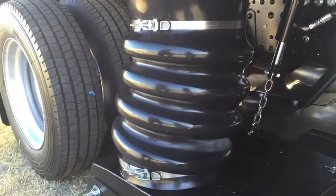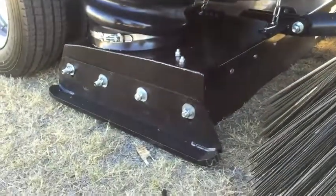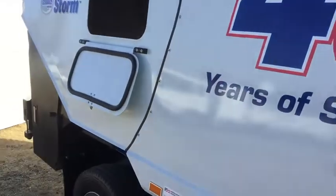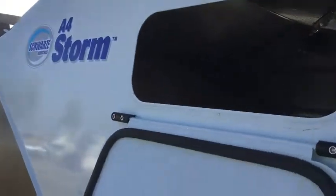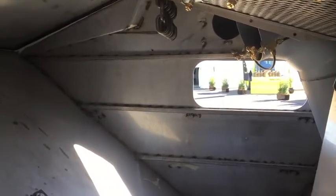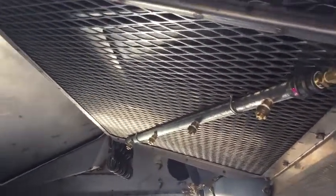305 millimetre high pressure down tube, and on the coinciding side we have the 305 millimetre uptake tube. Tungsten carbide skid for heavy duty wear, and a heavy steel gauge suction box. This is shrouded as standard in Australia. Inspection doors allow us to look inside — stainless steel hopper with a dust suppression system and a dust separator. There's a flap there, and chains coming down for high impact debris. We also have a screen up the top to keep debris from getting through to the fan.